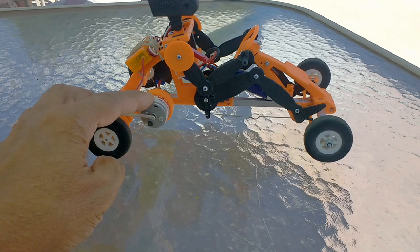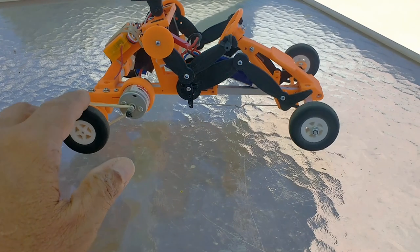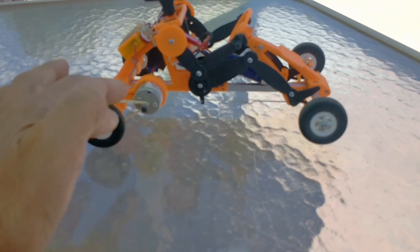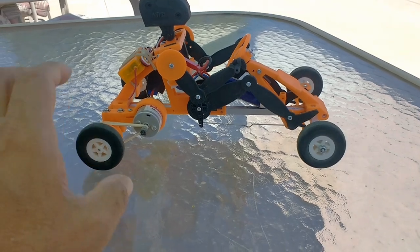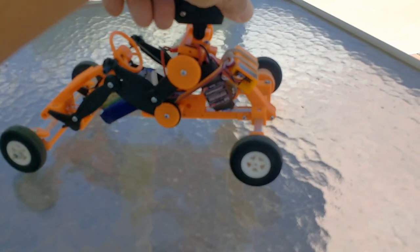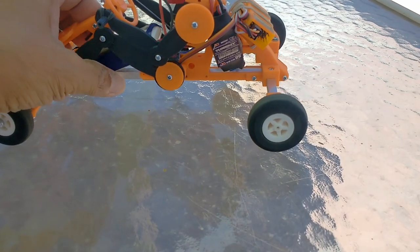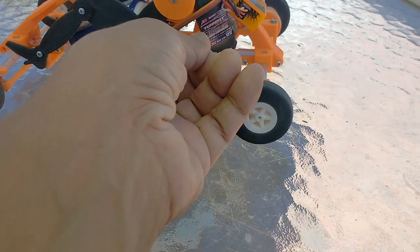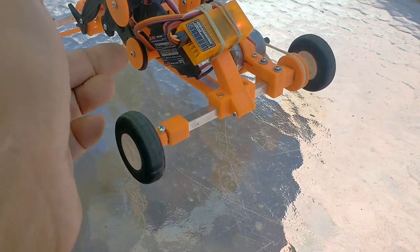And this is a DC brushed motor, very same one that we use on the MIA Robin 280 of 1999. So I had an extra batch of motors, so I decided to use these on this particular go-kart because it just keeps things a little bit simple and inexpensive. This is operated by a 2-cell LiPo battery, 850 milliamp hour, via a Turnigy brushed 20 amp ESC. It really doesn't pull 20 amps, but this is one that I had, so this is the one that I used.